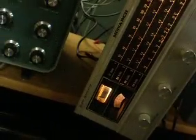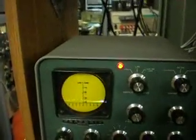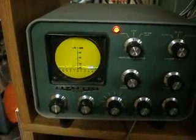A converter can be set up for just about any frequency. Right now it's taking a 455 IF input from the little Monarch shortwave radio and converting it to 3395 for the SB620.